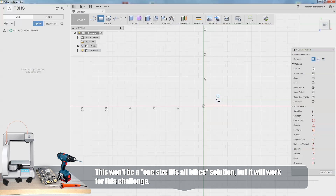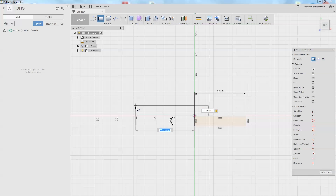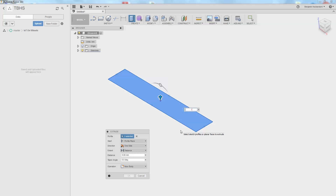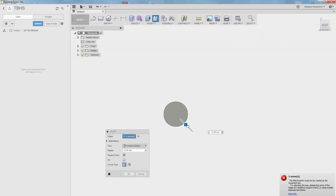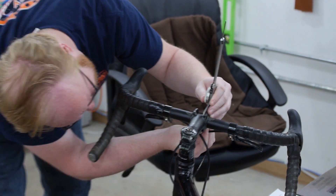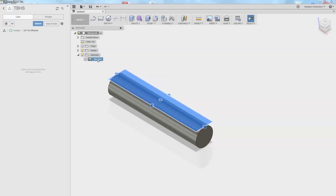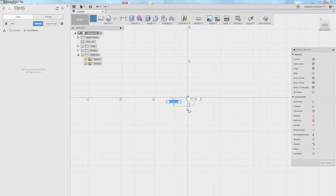That gives us a total of 135 millimeters. Center point: 135 divided by 2, and 26 divided by 2 is 13, then the same thing in the other direction — 13 by 135 divided by 2 — and then we can complete the square. I'll get rid of this; Fusion is going to complain about constraints. So I'm going to go down 26 millimeters like that, then fillet it — sometimes you just have to pick how you say 'fillet' or 'fillet,' like Jimmy Buffett.